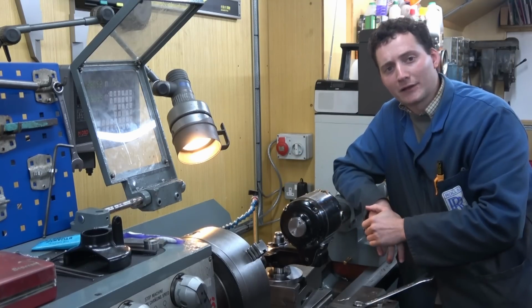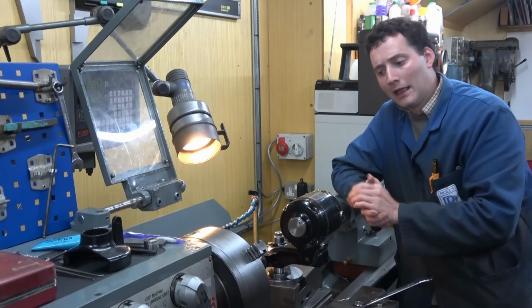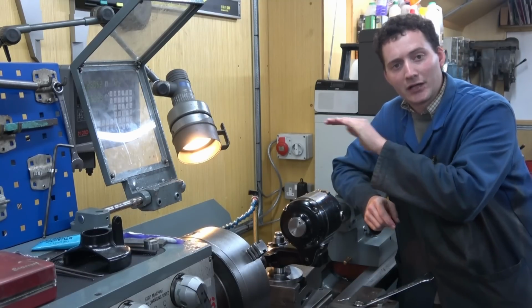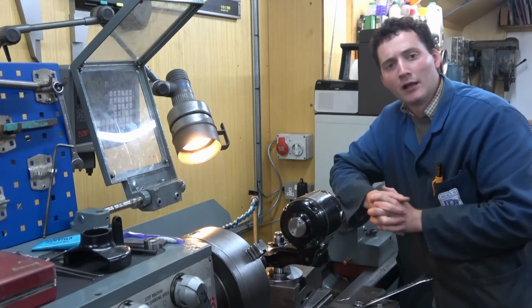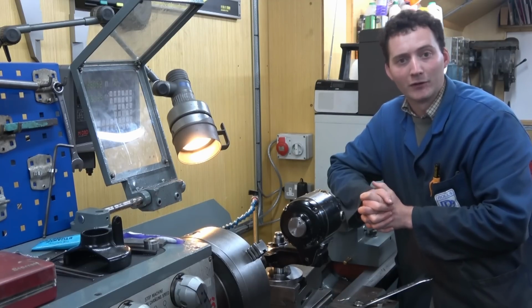But this very specific topic around bar sagging and indicator drooping, no, it's not something I've had to contend with before, and it applies very specifically to the errors incurred when using an indicator that is rotating about the horizontal plane and the effects of gravity on that indicator and bar arrangement. So I'll take this one step at a time, and to begin I'll show you a little demonstration to explain the concept of indicator sag.